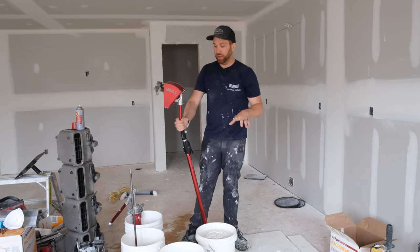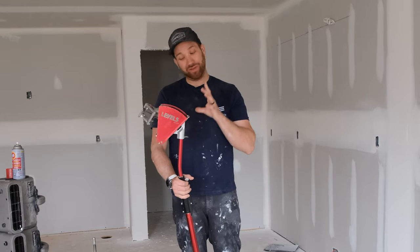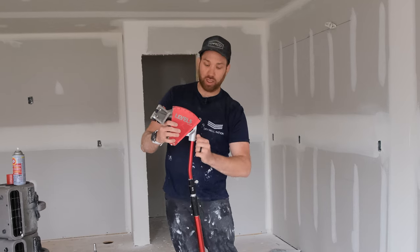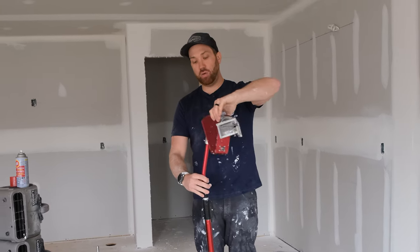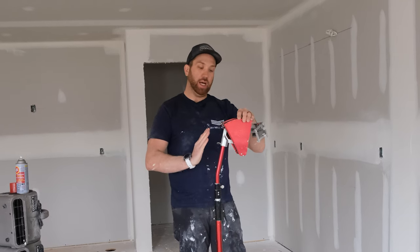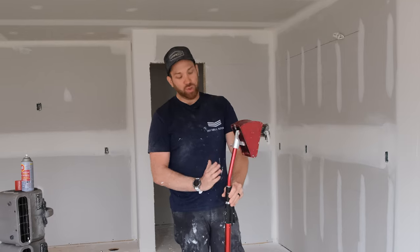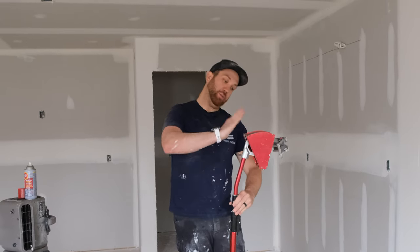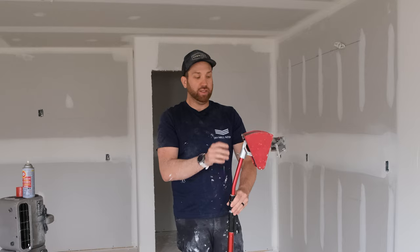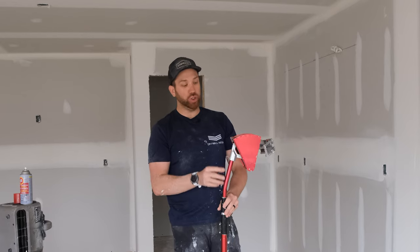The first thing I want to mention before we even get our pump in the mud is how your corner box should be installed on your handle. In my opinion, this is probably the number one mistake that most people make — when they first get their corner box they oftentimes put it on the wrong way. Instinctively you'd think the arm would go like that, but that doesn't apply the proper leverage to the wall.